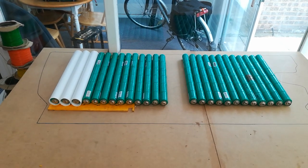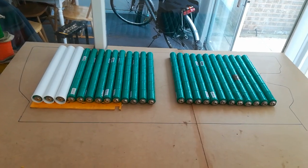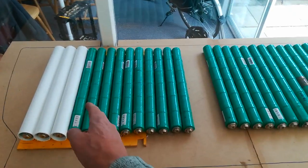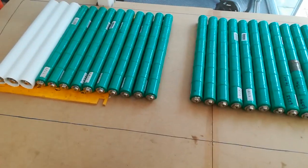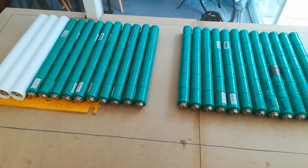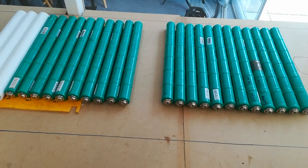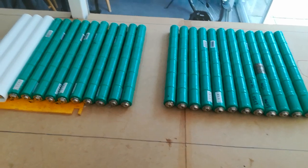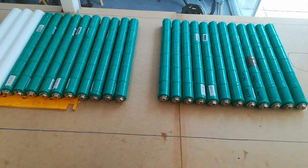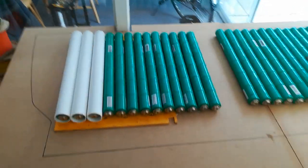That's what I'm looking at for UK cars and a possible rally car conversion — a hybrid supercap conversion — just to make it easy. You could have a really good pack of nice quality sticks, 24 or 26, whatever you wanted — a nice high voltage pack — which would constantly dump its load into the supercapacitor pack on stages, and obviously recharge from the supercapacitors as voltage is available and as there is sufficient potential to do so.